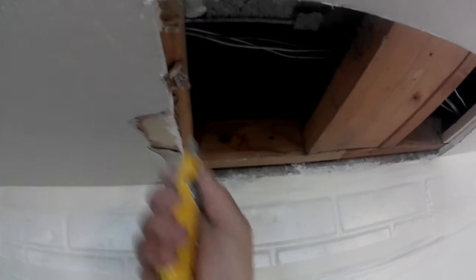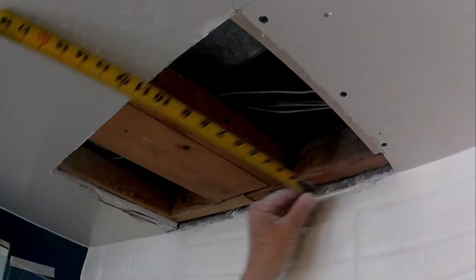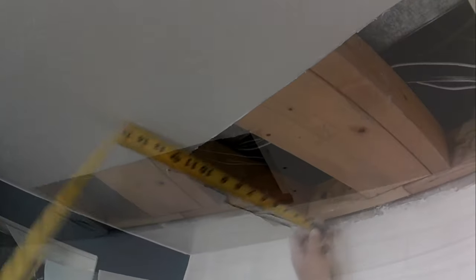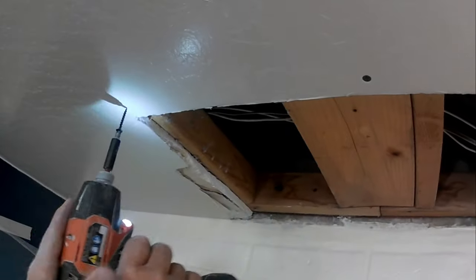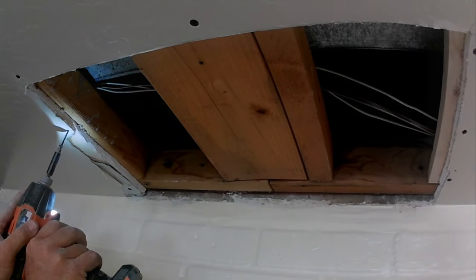If there are no studs and you're not able to cut center on the stud, just add wood backing — anything works: one by twos, two by fours, wood sheeting. They also have metal clips for patching; they're all right, I'll use them for hard-to-reach spots, but it's easier just to buy some one by twos. I like one by threes — they're a little more expensive but they don't split. One by fours are awesome if you can get them, and two by fours of course, but you just do what you've got.